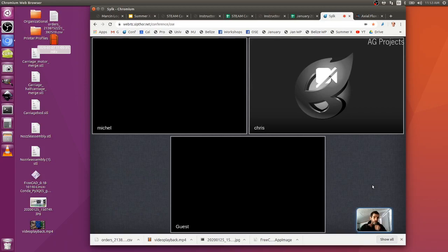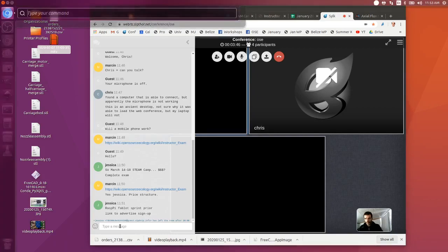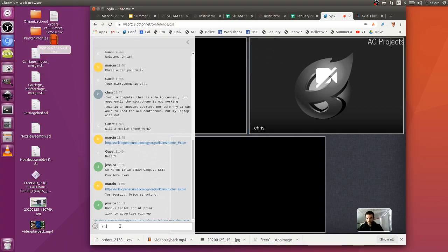Mitch Altman does Arduino kits you can buy off the shelf but that's a bit like cheating since everything is prepared. Strip board is good. There was a working breadboard Arduino but with a different programmer. There were three different models based on different chips. There's a problem with the CH340 - it didn't work very well. Using different programmers, and the breadboard design will be transferred to a strip board, which should take one or two days.